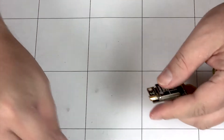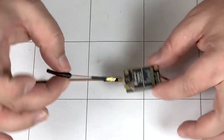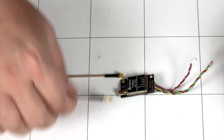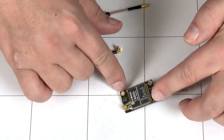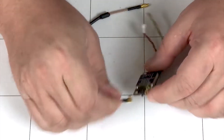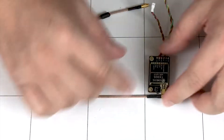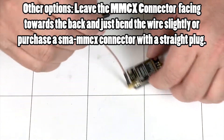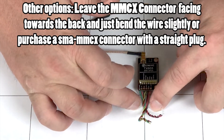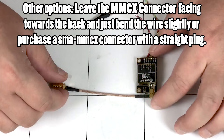If you don't want to use the dipole and want to use a standard SMA connector, no problem — they've got you covered. Notice that the SMA connector that comes with it is at a right angle. So if you're using the dipole, you'd set it up so the front of your quad is here, the back is here, and your antenna comes out the back. If you're going to use the SMA connector, you'd set it into your stack this way. You can put it this way or this way — whichever you feel comfortable with. The right angle MMCX connects in with a nice satisfying click and runs to the back of your craft. You can bolt it into your stack either orientation, depending on which side your video transmitter pads are on.